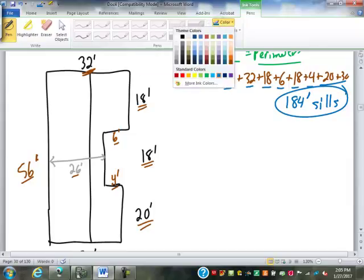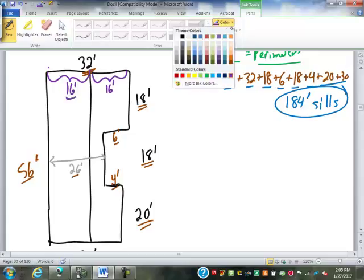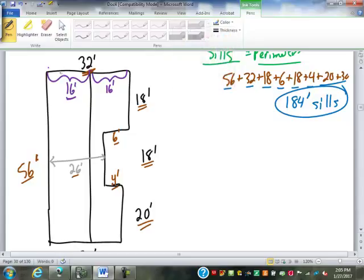Now again, we're not doing the girders or the beam, so we're going to jump from there to our joists. I had mentioned to assume that this beam was at 16 feet at the midspan of this longest span. So the span here is 16 feet. The run on this side is the full 56 feet. So those are 16-foot joists that we're going to need there.